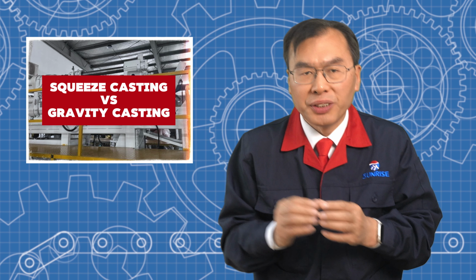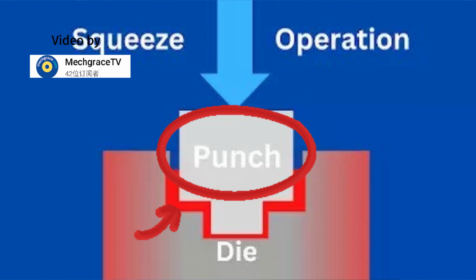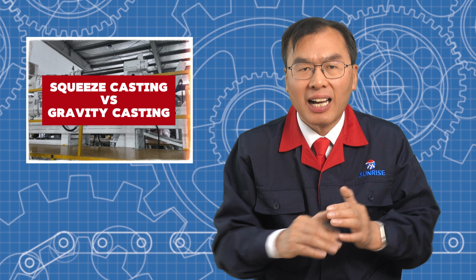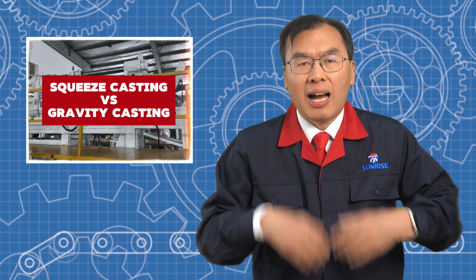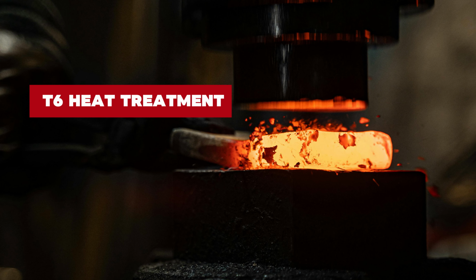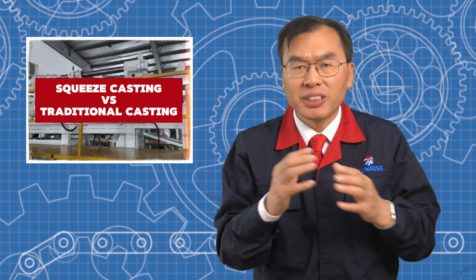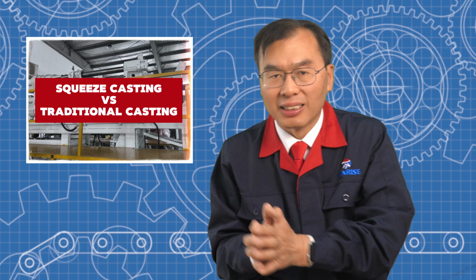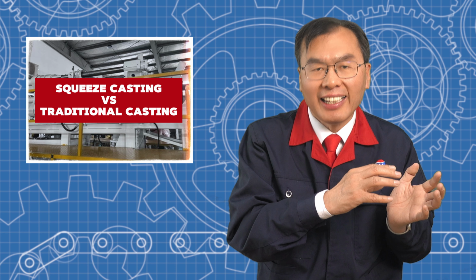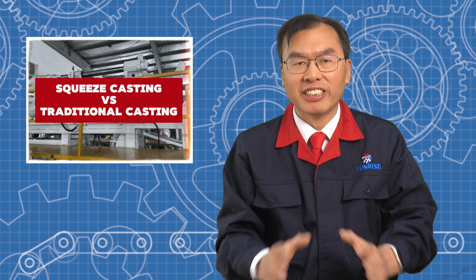Compared to gravity casting, squeeze castings produce parts with much better mechanical performance and overall quality. Because pressure is applied during solidification, the metal structure becomes denser, which means higher tensile strength and better elongation. Unlike gravity cast parts, squeeze castings can also be heat treated, even to T6 condition, which further improves strength and functionality. On the quality side, squeeze casting offers better control over porosity, smooth surfaces, and higher material efficiency. Since there's no need for a complex gating system, less metal is wasted, and the overall production process is more efficient.